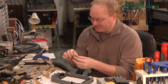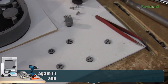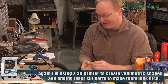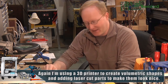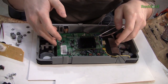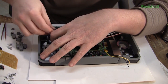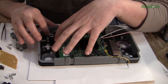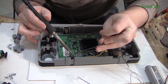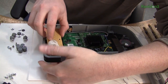Now I'm going to put together all the buttons. I made 3D printed raised portions for the buttons, and then I laser cut the graphics so they'll look nice — there's a home button, volume buttons, all sorts of stuff. We put the LCD in first because it's the largest component, and we want to make sure it's lined up to the aperture in the front of the unit. I'm also going to put the speaker at the lowest level as well. There are a lot of things to put in and we have to make sure they're in the right order, like this power switch. We make sure everything is aligned, then we insert our 3D printed buttons and D-pad.